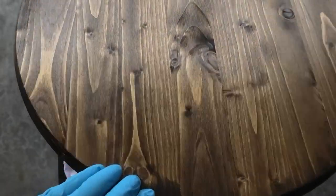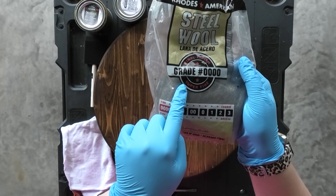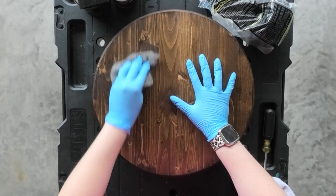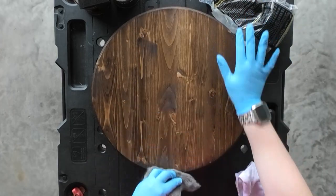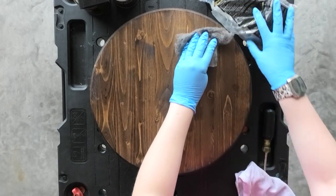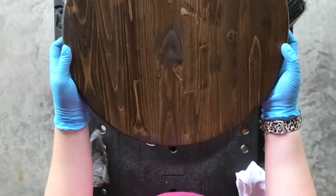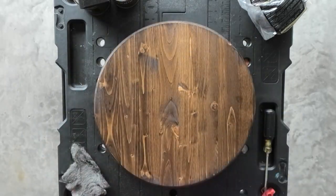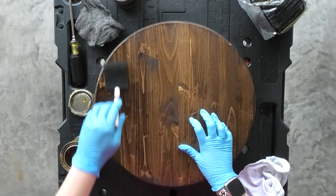You can see in person where a lot of the bubbles have dried into the polyurethane after the first coat is completely dry. So now we're going to do the second coat of polyurethane and we're also going to use some steel wool to get rid of a lot of those bubbles. Use a really fine steel wool — I use the four-aught or 4/0 steel wool that you can buy at Lowe's. Grab a piece out of your bag and rub it along in the direction of the wood grain, very similar to staining — that's really going to smooth out the surface and smooth out a lot of those bubbles. After you're done, be sure to wipe off the little steel wool dust pieces. Then apply a second coat of polyurethane exactly the way you applied the first coat — it doesn't need to be super thick, it just needs to coat everything really well.